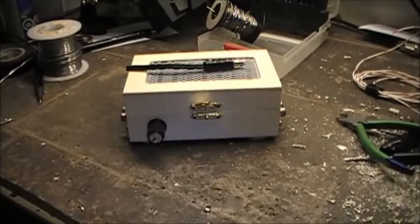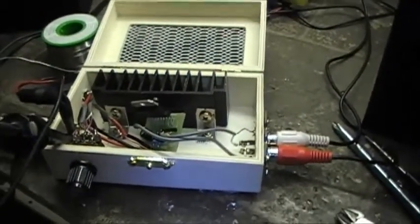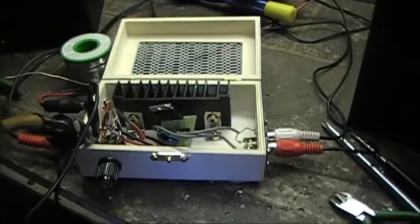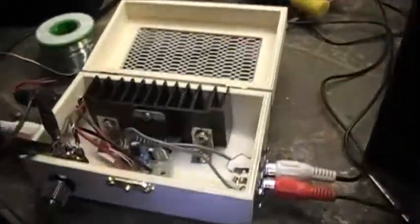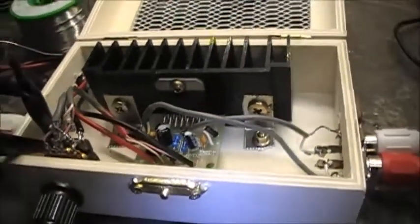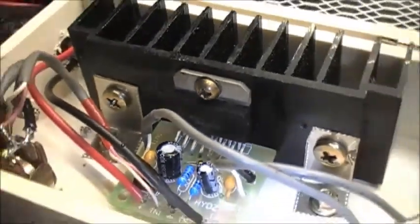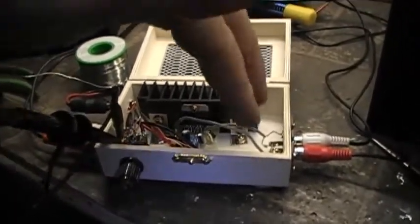Well boys, I tried the audio amplifier — attempted to try it — and unfortunately I have audio going into it but there's absolutely nothing coming out of it. I'm going to show you on the scope now what I found. The TDA7297 is amplifying no audio at all. I verified everything is wired up right: power is hooked up right, audio inputs right, output is right, and I have a couple 8 ohm 50 watt speakers.